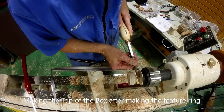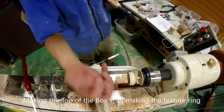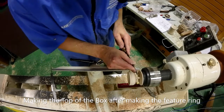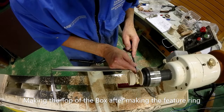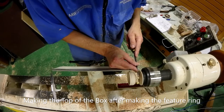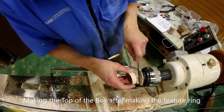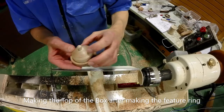Still way too thick. No, so sanding would be the right time to sand now. As I say, I wiggle my way in there. Not a lot of space in there, so you sort of can make it happen. Probably the end. Probably cut it off. If I cut it off with the tool, then sometimes the end grain will break out, and I just want to avoid that. So in this case, I'm just taking that as is and then sand the outside. So we have that part of the top, that is okay.